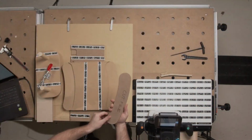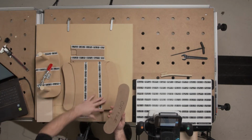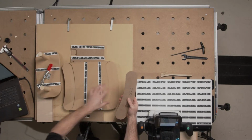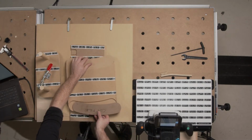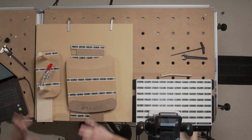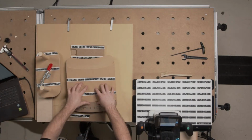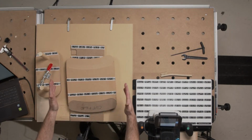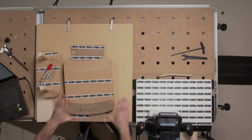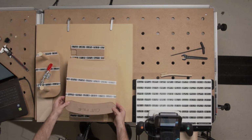So if I wanted to cut this, there is one path where you design this thoroughly in CAD. But if I've got this file ready to go and I want to just get a fixture to hold it in place, which kind of bridges the two worlds we've been discussing: there's the ideation and prototype development phase, and then there's the manufacturing process phase. What you're seeing here is the manufacturing process phase, but if it's fast enough, you could use this technique to develop your idea as well, just to literally make a few and test them. It's cheap material, MDF.